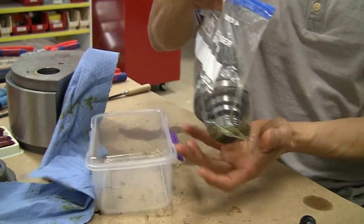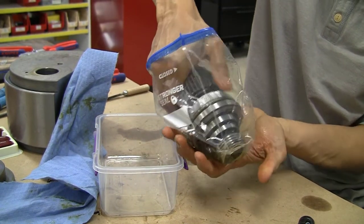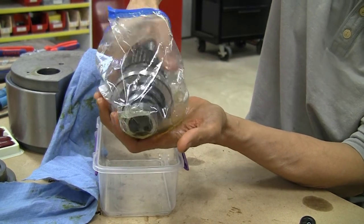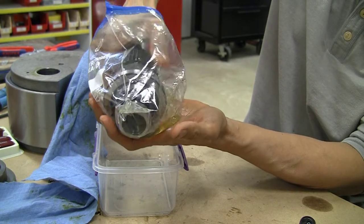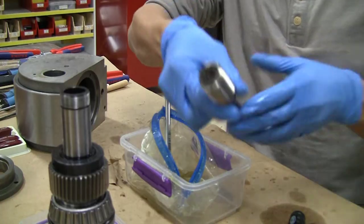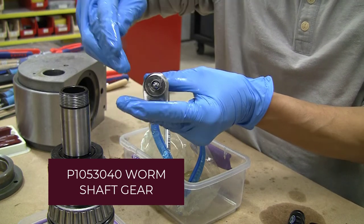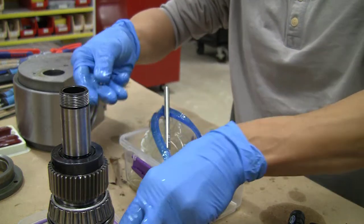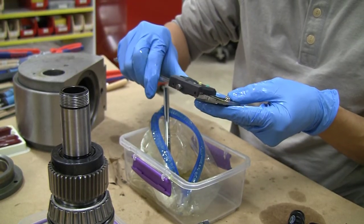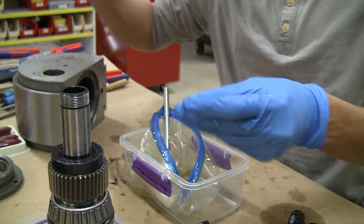Time for a good clean up now. I have put some mineral spirits in there and the whole spindle assembly along with it, cleaning it out. As I am running the bearing through the mineral spirits, the grease is coming off very easily and it does not seem to be rough at all. Here is the worm after having run it through the grease cleaner, and you can see its tip has a tiny little ball bearing that I presume helps with proper tensioning — it is just under 6 millimeters in diameter.